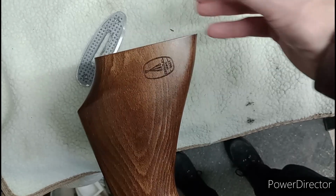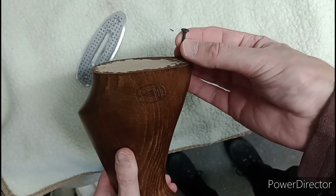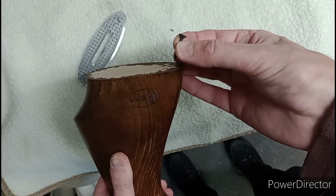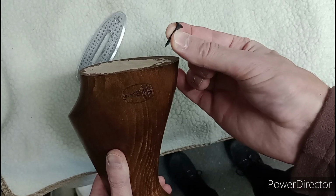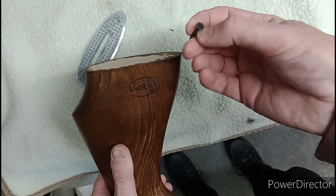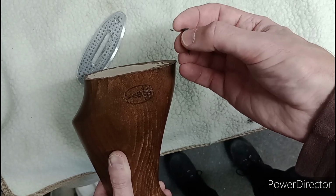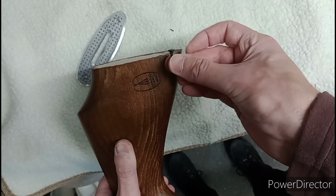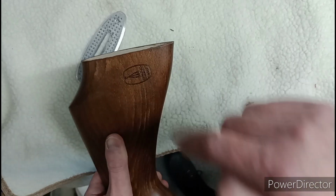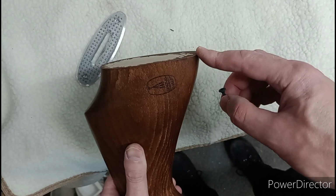Yeah. Right, just one thing actually I do want to bring up. Criticism of me giving a guide of what depth of hole to drill compared to the screw. I use the whole length of the screw and maybe a little bit more as the depth to drill the hole. And people are saying, oh, why are you doing that? Because you're not using the whole length of the screw in the wood, are you? Because you've got the countersink. Yeah, but you've got to remember, if you only drill it to the exact length of the screw, you've got a real stress concentration down at the bottom of that hole, and you risk busting your wood. And you don't want to bust your wood when you're screwing into the bottom hole.